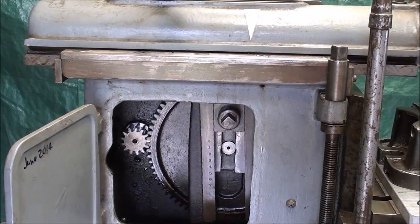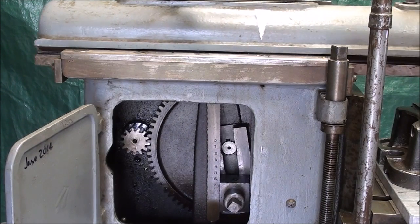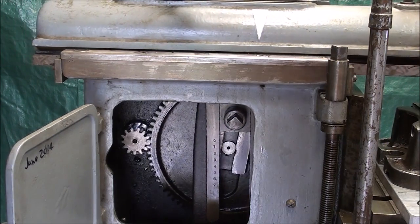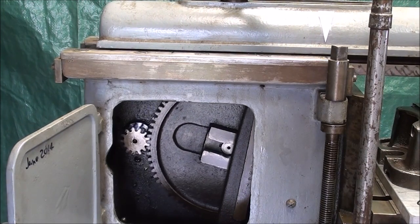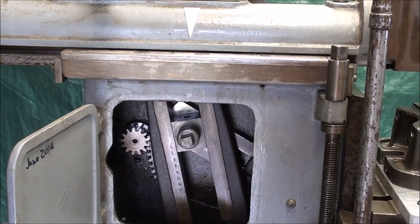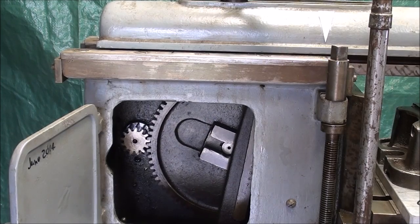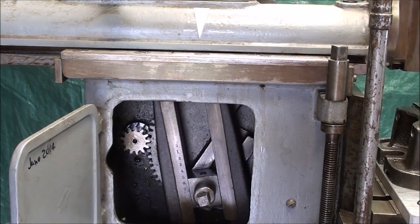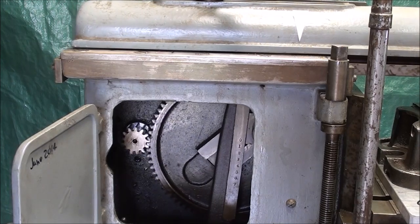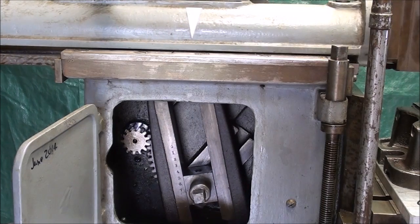Just a quick note on the direction of rotation here: normally the big bull gear is going to turn clockwise, and that will give you a faster speed in return than it does for cutting. But one man was quick to comment on that, saying that all of the larger shapers he was familiar with had forward and reverse switches. So there were times when they ran it in reverse, so you had a faster forward motion because they were doing slotting operations or keyway operations where they were actually cutting on the backward stroke. In that case, the forward stroke was the faster stroke, and the return stroke was the cutting stroke. That is why you might see some of these machines with a reversing switch rather than just an on and off switch such as this one has.